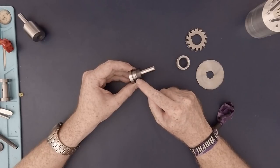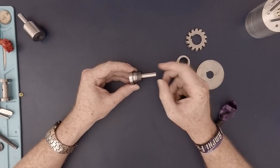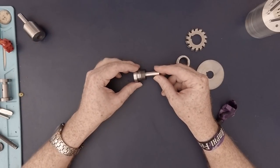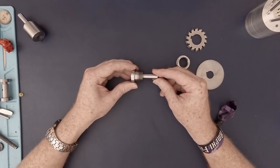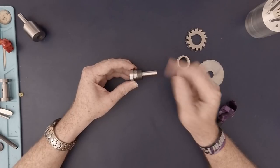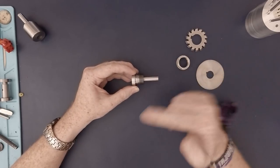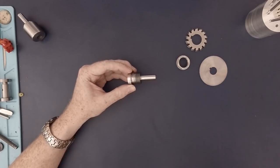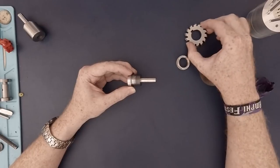The overall machining of this part is slightly more complex, and that requires the thread to be built into it. But the other design would probably have been better if it had a thread built into it anyway, rather than requiring a separate nut. I thought much more carefully about the runout on this tool, because slitting saws tend to be not very good for runout anyway, so it wasn't as critical, whereas gear cutting tools need to have much better runout.